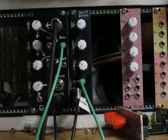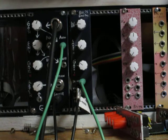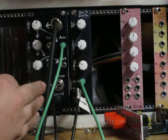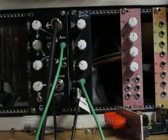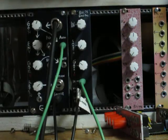And I should also say that the input knob is attenuating a signal before an amplifier. So if you don't have the guitar input module and you're trying to extract envelopes, you can still input something with a non-synth level signal and be able to amplify it up to synth level signals. But yeah, I'm gonna just pick really softly.